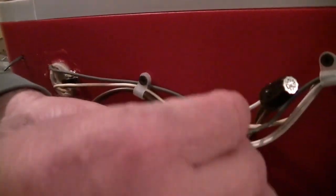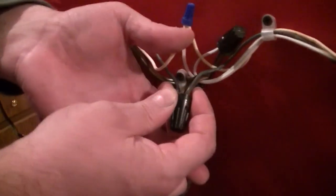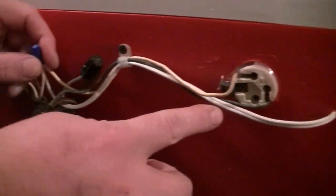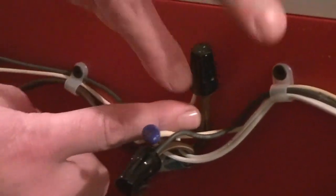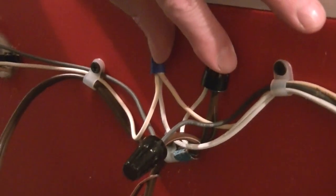They run out. Okay, then, one side of the black wires goes to one side of your power supply. One side of your thermostat hooks to the white wires that come from the bulbs over here. Then the other side of your thermostat wire goes to the other side of your power source. Okay, 3 contact points, that is all. Only gotta make contact 3 places to make this work.